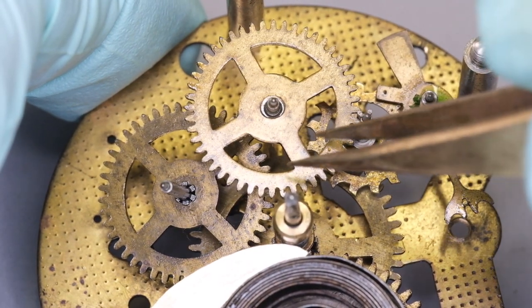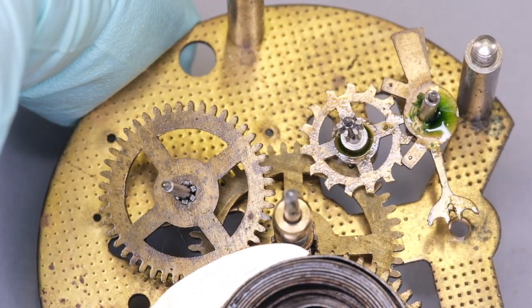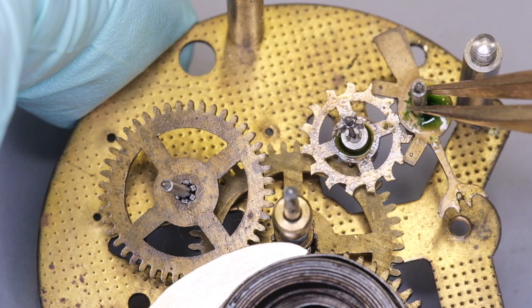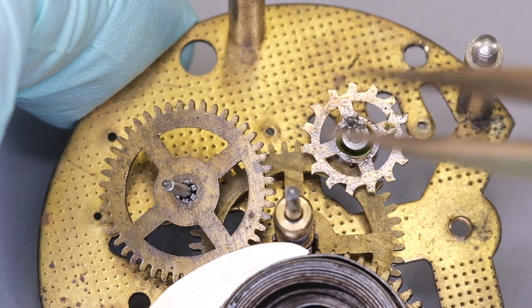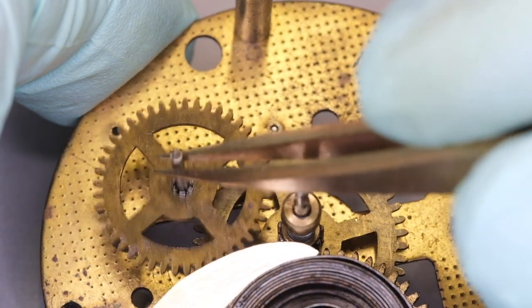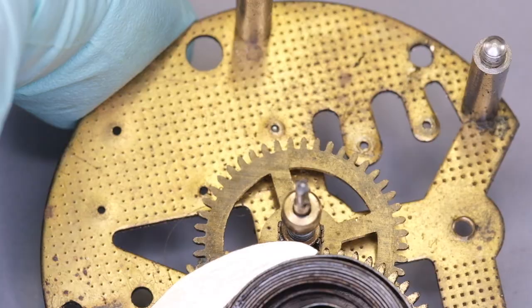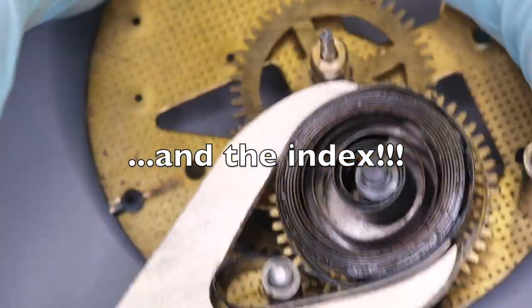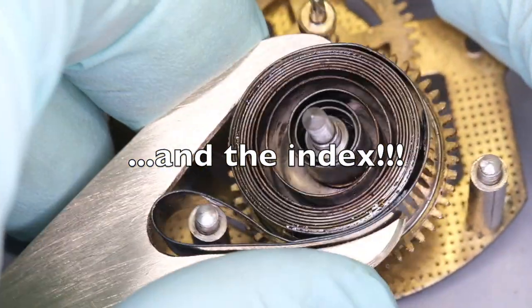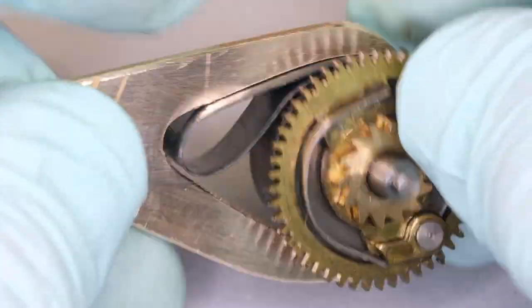We lift the components out one by one, checking that they're intact, but it's a good opportunity at this point, if it's the first time you've disassembled a clock like this, to take lots of photographs and make sketches of the relative positions of things. In fact, when I came to reassemble the centre arbor, the clutch, I did it wrong the first time, so easy to make a mistake. I should have looked at my own photographs.